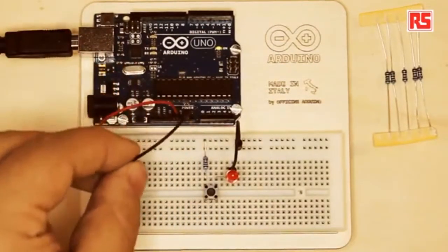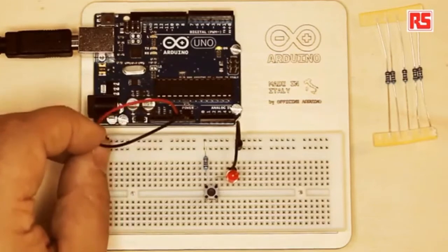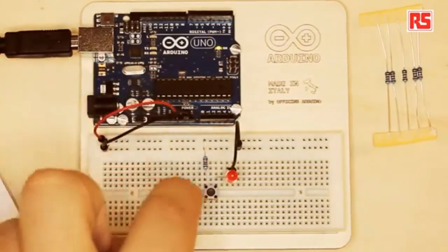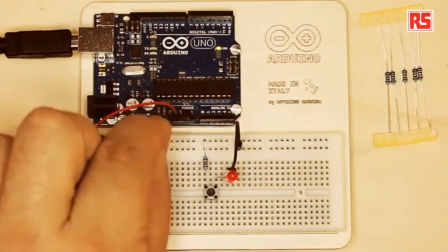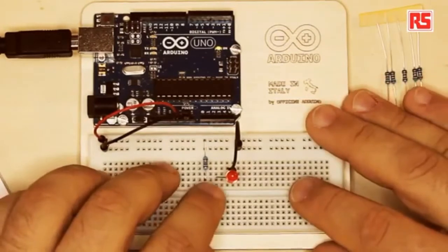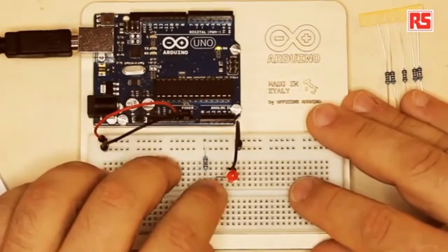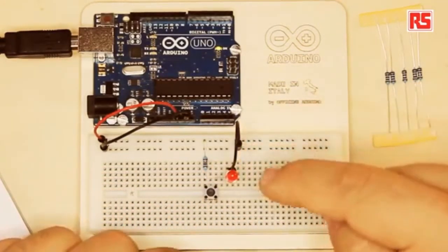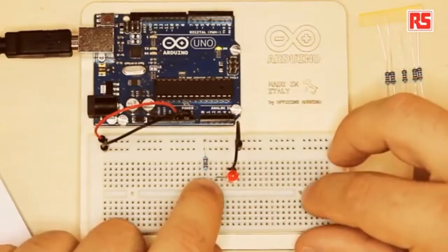If I connect the black wire to the other line on the breadboard, I've connected 5 volts to the first line of holes and ground to the second. Now, if everything is done correctly, if I press the button, I'm going to connect the resistor to the LED, completing the circuit, and the LED will light up. It's working! So the ability to convert electricity into another physical phenomenon — like light — makes the LED a transducer. A transducer is a component which converts electricity into something else.